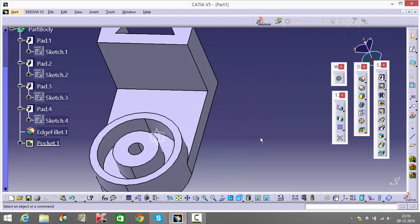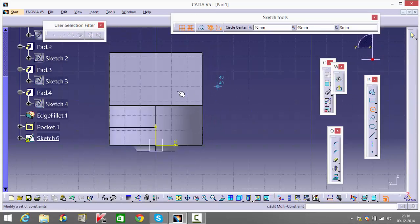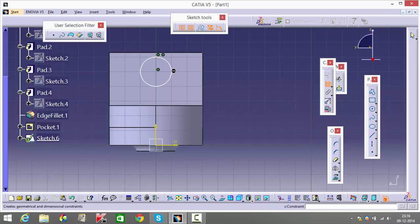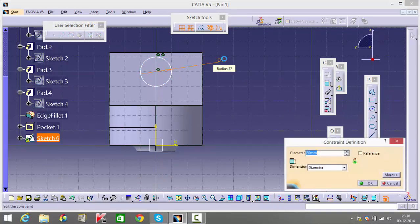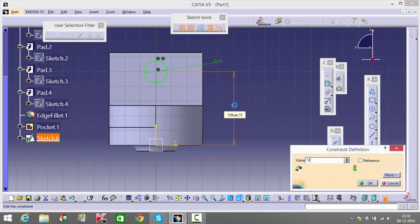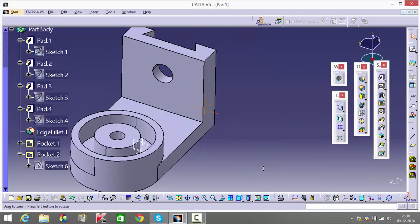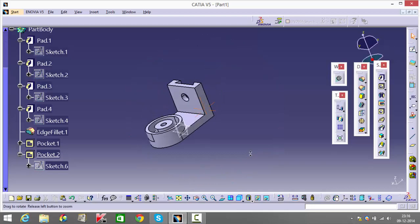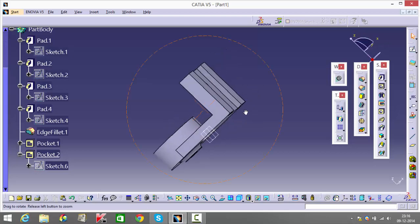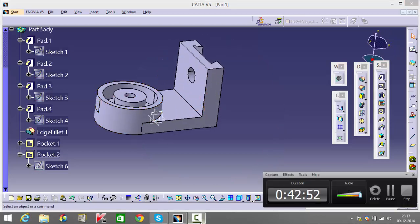Wait — there's a hole here. Don't forget to check your figure twice or thrice to make sure you've done everything. This hole is 15, and the height is given in parts: 12 plus 9 plus 21. Go back and pocket this — the depth doesn't need to be mentioned because they want the hole to be through. There you go — figure 3.60 done.